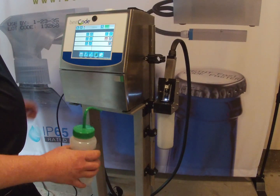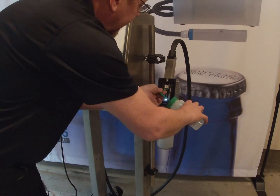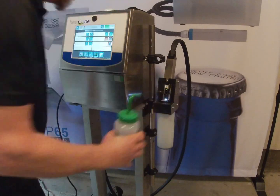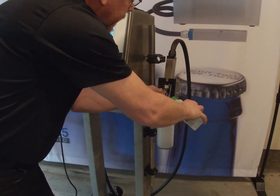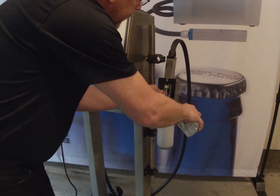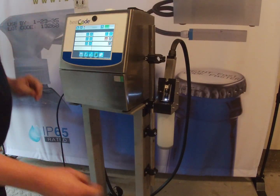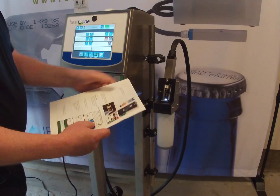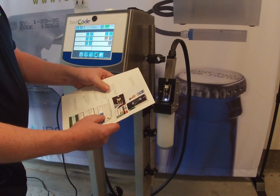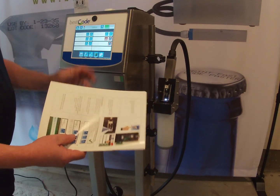And we're going to do that, that's once. We're going to do that again. So hit the button, get the cleaner, fire it up at the nozzle plate. So that's done the back flush. And looking onto the booklet again, dry the print head, then start the jet normally with errors and high voltage and phase enabled. So the print head will dry, give it a few minutes.